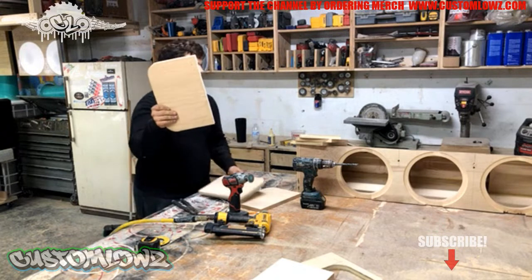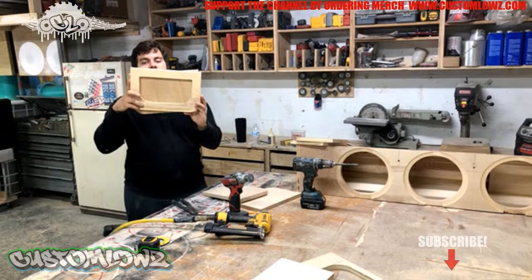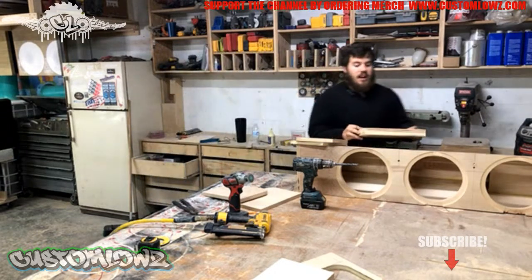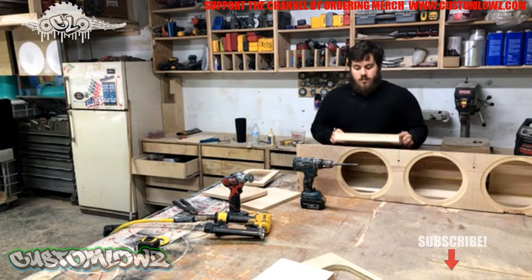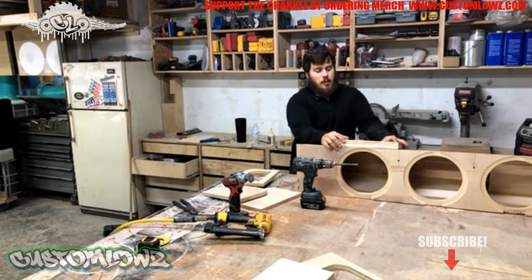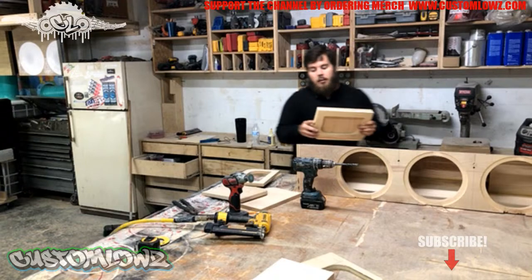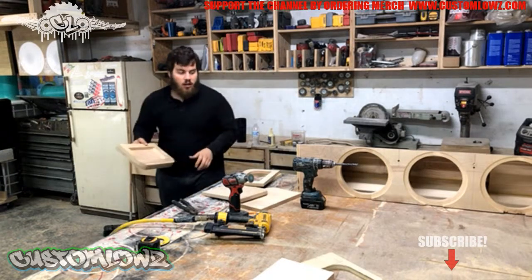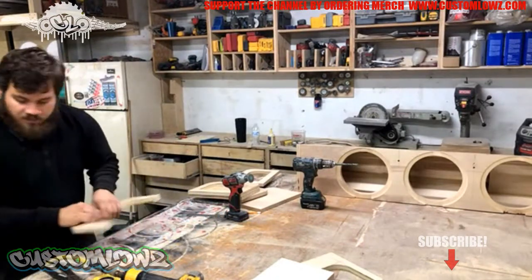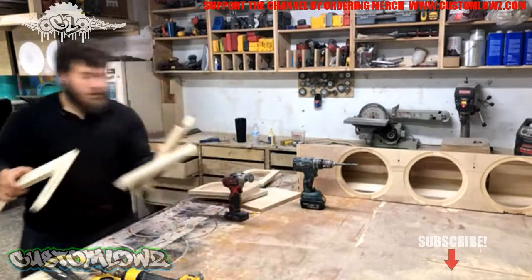All right, so we got these pieces here and these pieces here. Basically, they're going to go together and create like a 3/4 inch space that the motors will have extra for clearance. Now, obviously, this does kind of protrude a lot off the top. I'm going to take a big router bit and actually put a detail on all four corners. Might even round this off a little bit first, but for now, we'll get them started by getting them glued together. And this is trash. This is trash. Scrap trash.